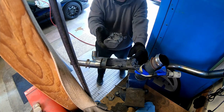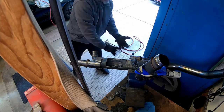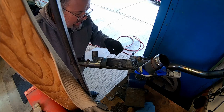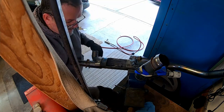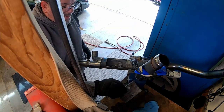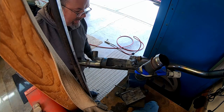There's the majority of it right there. Now I'm just going to go in and scrape all this loose stuff out of here and scrape the lid clean, and we'll be ready to weld it back together.